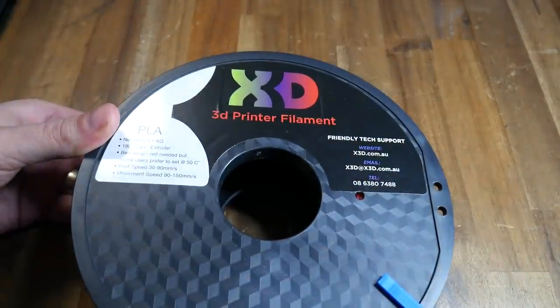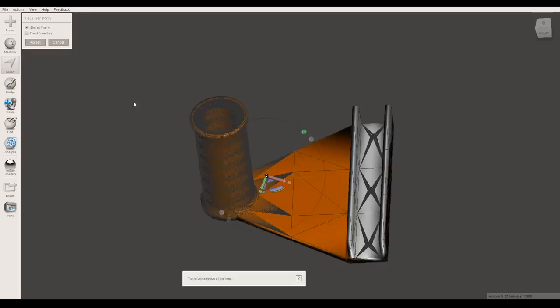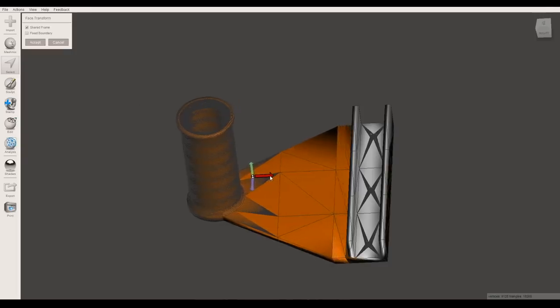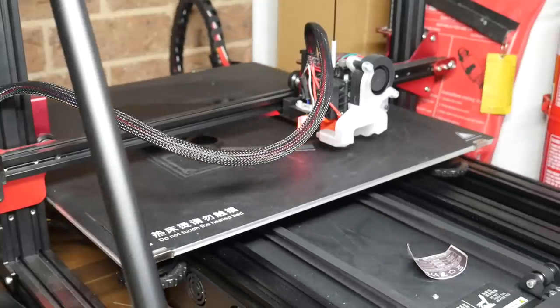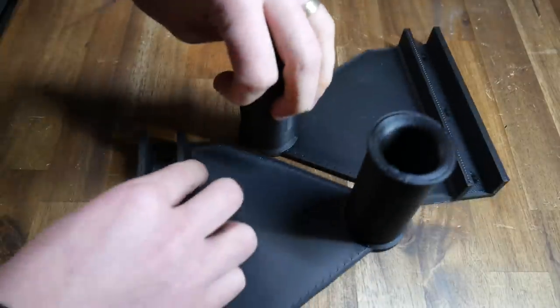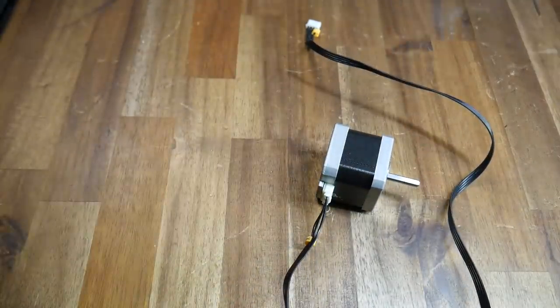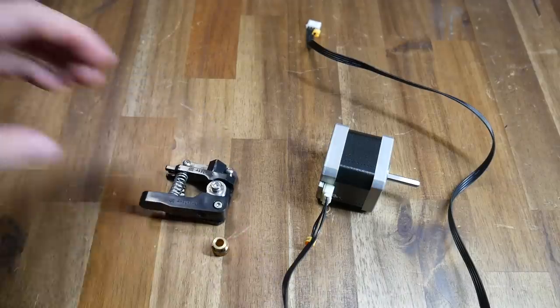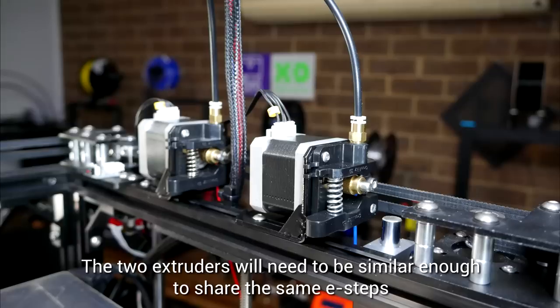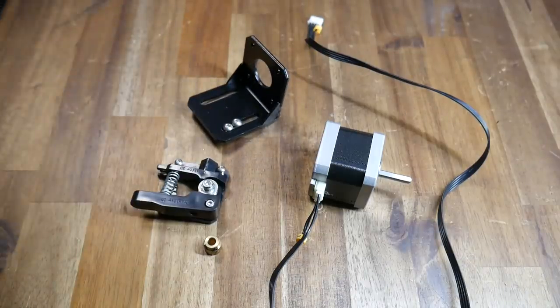For either of these, since we're adding a second roll of filament, there are some other parts that we still require. One of those is a second filament spool holder, and I found a design that looked like it would suit my printer on Thingiverse, put it into MeshMixer, and elongated it to give a little more clearance for my frame. The CR10 Max with the Hemera Volcano hotend and large nozzle is perfect for pumping out this type of print quickly, and after a few hours I had my two new holders. The other things we're going to need are a spare stepper motor as well as enough cabling to go back to the mainboard. You need an extruder assembly to go on that stepper motor — it needs to be quite similar to your original extruder, as the firmware requires you to have the same e-steps for the new and old extruder. You're also going to need a bracket to mount it to the frame, and there are plenty of free designs to print if you need one.